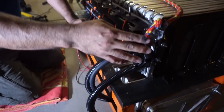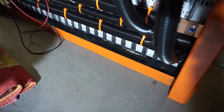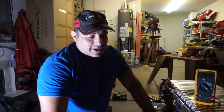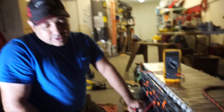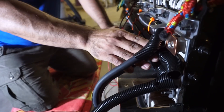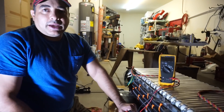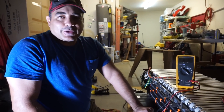We'll make another piece of loom to cover this wire and cover the back side of the bus bar. We've been taking this — which we've already made — and wrapping it around to cover everything. We'll bring another piece in and do the entire cable, covering everything up so there are no slipped wrenches. It's all wired up. We had to modify our plan — you can see the hole where we thought we could get a wire through, but these are just too thick, so making a bigger loop to get the wire away from the other bus bars was the better idea. That's our wiring setup.